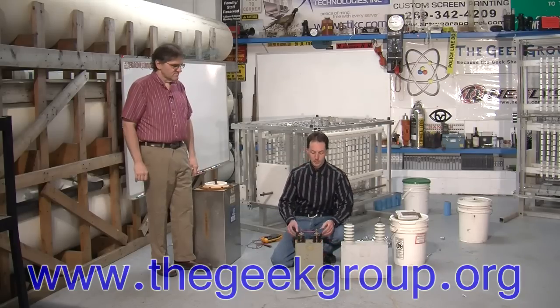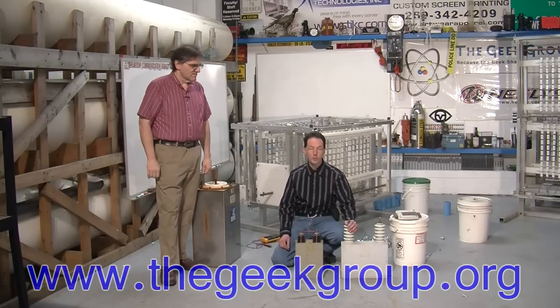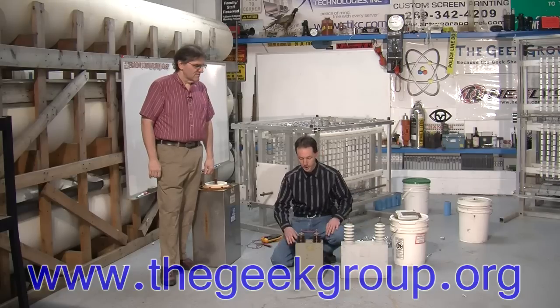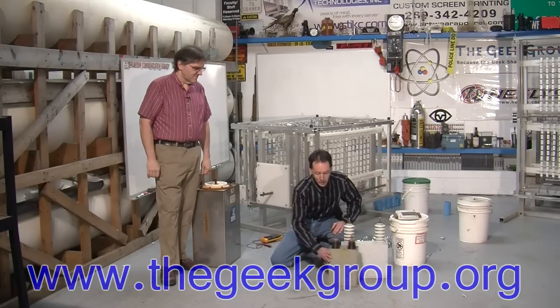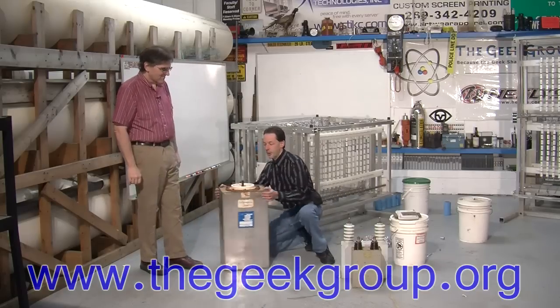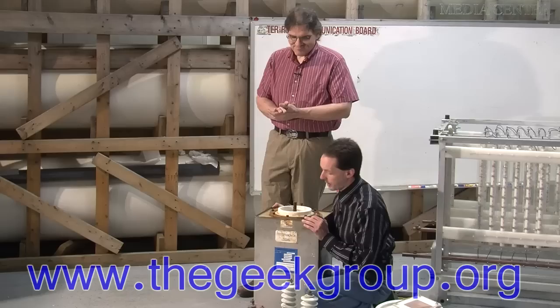When you're storing your caps, by the way, always put a drain wire on them for safety. There isn't one on this, I don't know why, because we're idiots. But this is a PFC cap, and it's got internal resistors, so I'm not worried about it. But for big pulse caps, and this is a really big pulse cap. Yeah, these are the fun ones. This is about 300 pounds worth of capacitor.